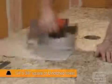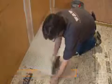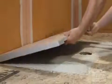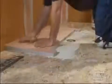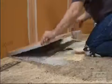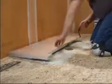Apply unmodified thin-set mortar to the substrate using a 1/4 by 3/8 square or U-notch trowel. Burn the thin-set mortar into the substrate with the flat side of the trowel and then comb additional mortar using the notch side. Solidly embed the first section of the shower tray into the thin-set mortar. Check the underside of the tray to ensure full coverage is achieved. Re-embed the shower tray.